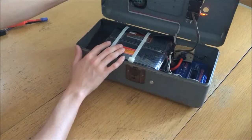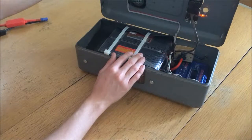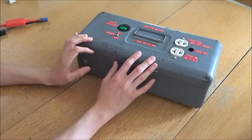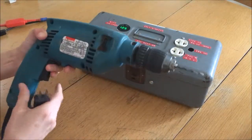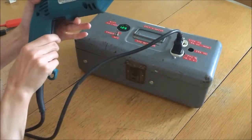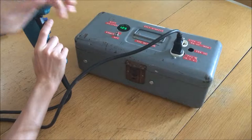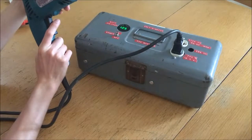Overall, it's been constructed from parts you can get at the hardware store or on eBay, and it was a really fun project to build. If you want a versatile source of power you can take pretty much anywhere, this is a great option. This one is quite powerful — I'll demonstrate its performance with this Makita 5-amp electric hammer drill. I plug it in and it works quite well. The voltage only drops a little bit, but the drill runs perfectly fine, because the inverter is rated up to 750 watts or around six and a half amps — it runs the drill quite comfortably.